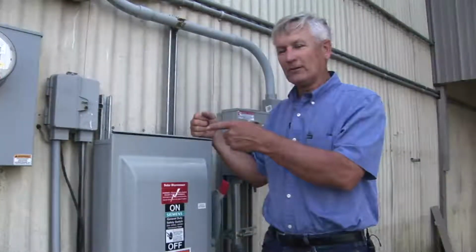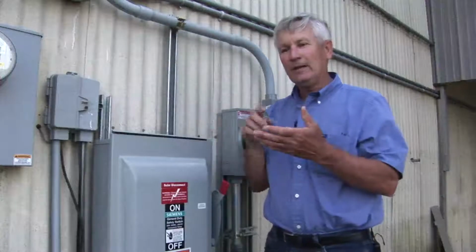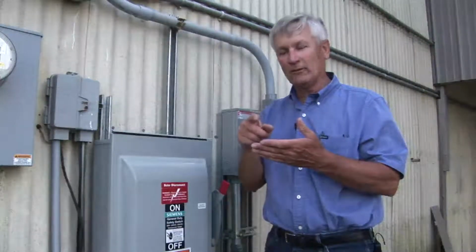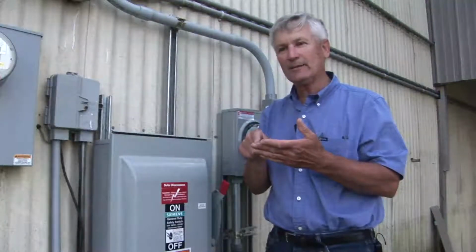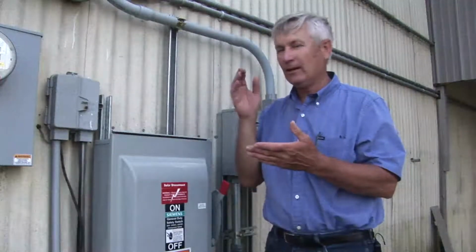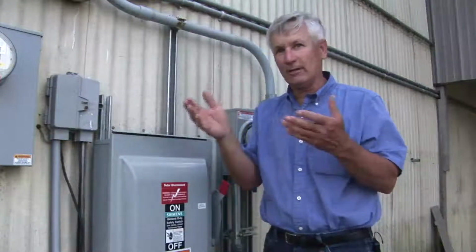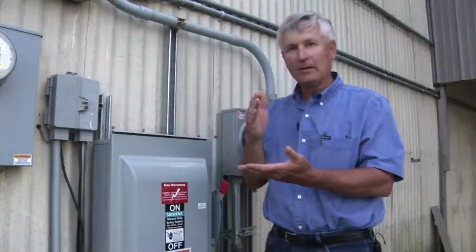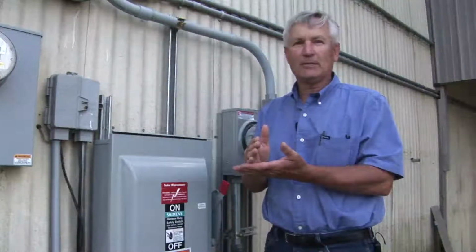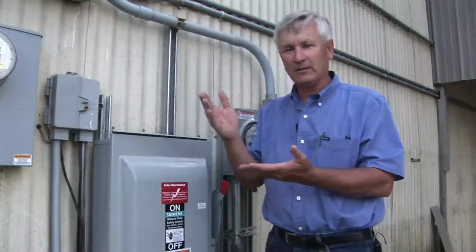Also, on the inverters on the inside of this building, they test for power in the grid every 1/60th of a second. So 60 times per second they're testing that power. If that power in that grid shuts down due to an electrical storm or pole going down or whatever, at that point in time, that power stops. So no one will get hurt fixing the lines or whatever.